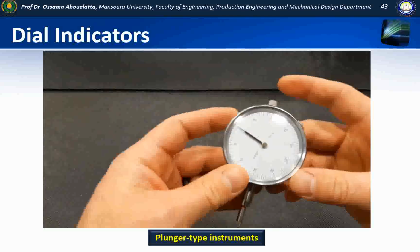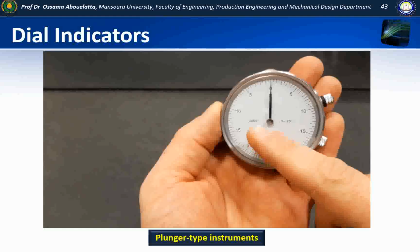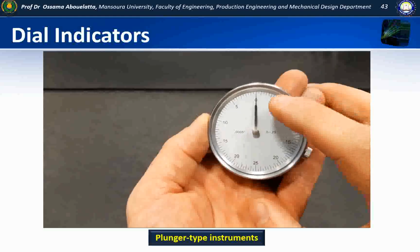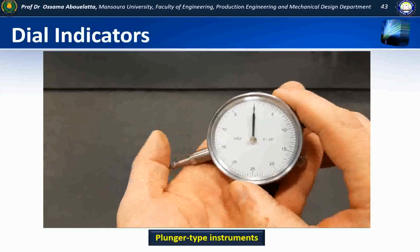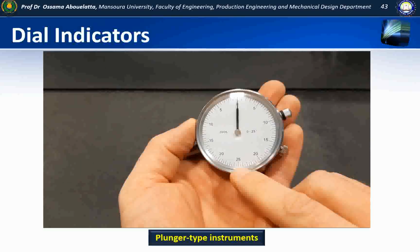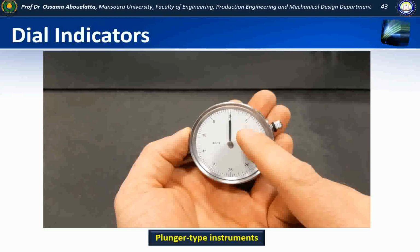I want to take a second and just talk about the dial indicator itself. Okay. If we look at the face here, we've got a couple of marks. First one here on this side indicates what each increment on the dial indicator means. In this case, we're talking half a thou, or 5/10,000ths of an inch. What that means is, for each of the small ticks, you see there's a small one, and then a longer one, and then a small one, and a longer one. Each of the small ones is going to be half a thou, or 5/10 thou, and each of the long ones is going to be a full thou. If you come down to the bottom, you'll see that once we go 180 degrees on the dial, we have hit 25 1/1000ths of an inch in half thou increments. So this is going to be really important for us when we start to look at our taper and out of round, that we understand exactly how to read this gauge.